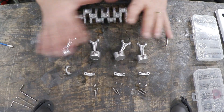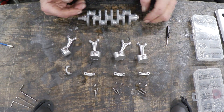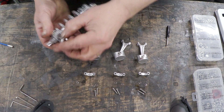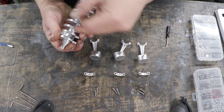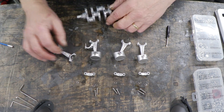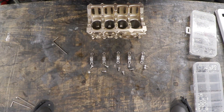Same procedure: I've looked at the next stage, laid out the bits I need. We're now supposed to attach the pistons to the crankshaft. I've found the crankshaft, laid out the bits, and what we do is attach that to there using the bottom of the big end and the screws provided with a couple of spring washers. You're meant to put a little bit of oil in there before you actually connect it up, so I'm going to do that.